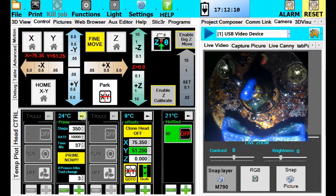If you do a lot of multi-head printing, or even if it is your first time, I would still suggest going through the other head and making sure that it is in fact at zero, zero, zero. As otherwise, having two offsets will cause there to be an additional problem.